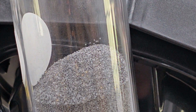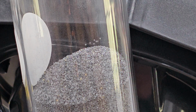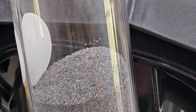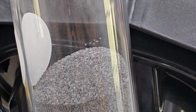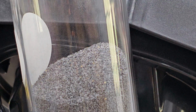You need to leave it on while you're running your press, because every time you pull the handle, powder falls out the bottom. You want the vibratory to go ahead and make sure that powder consistently drops back down in. It doesn't form any holes, air pockets, whatever it be. And on the larger rifle calibers, it helps keep everything consistent because it gives you a more thorough drop, because everything is loose as it falls in from the vibratory. So it keeps it from packing or clumping on certain powders that are notorious for that. And this is how the whole thing works. So don't think that just because you see it settle and stop that it's not doing its job. It positively is.